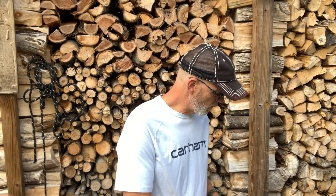How much wood are we going to use? Well, with the underground pipe you're going to need to determine how far away from the house you are — 50 foot, 30 foot, 100 foot — all of that is going to be a factor in how much wood you end up using. At 100 feet with the Thermopex you're probably dropping one to three degrees, and it only needs to be buried about a foot to a foot and a half deep. Once you're in the house, switch over to your PEX and things like that.